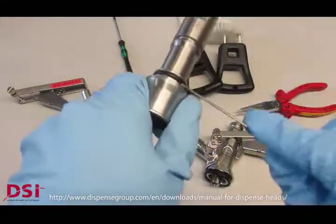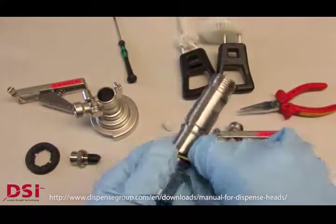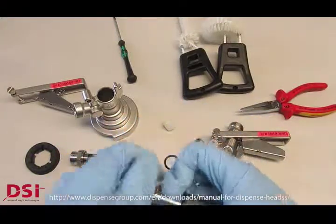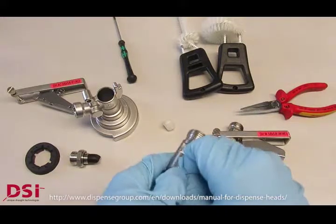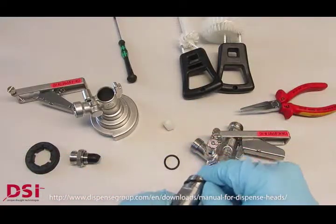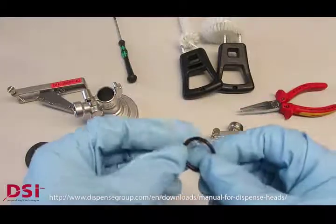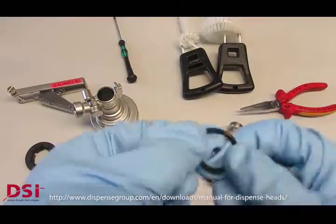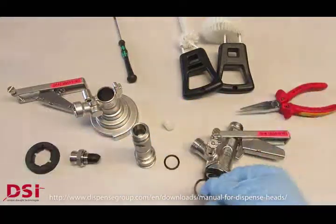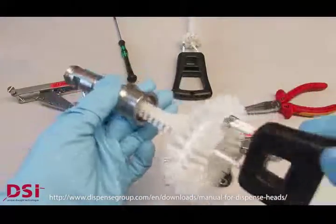Here you can go underneath the O-ring and get it out of the groove. As mentioned, don't use high force. Try to remove the O-ring carefully. If the O-ring is disassembled, check both rings. If there are damages, cracks, or anything else, dispose of the O-rings and use new ones. If you want to use new O-rings anyway, you can cut them off the piston instead of disassembling them.